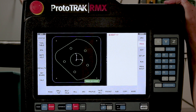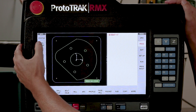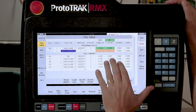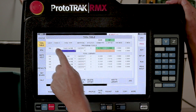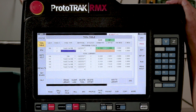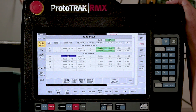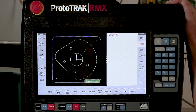Now I have to explain the tooling. I'm going to hit the tool table. Because I have a library for my tools with all my offsets already set, all I've got to do is tell it which tools I'm using. I've got the first tool already in there from when I did the rectangle, and all I've got to do is add this drill bit. I say this is going to be tool number two, it automatically puts that in there and I'm ready to go. Close that flyout window.